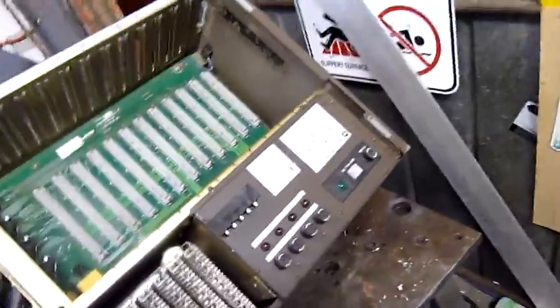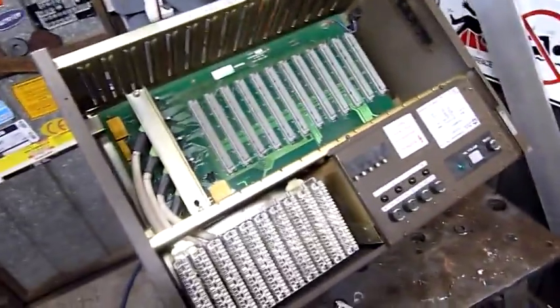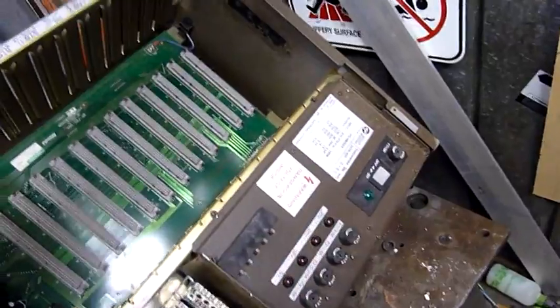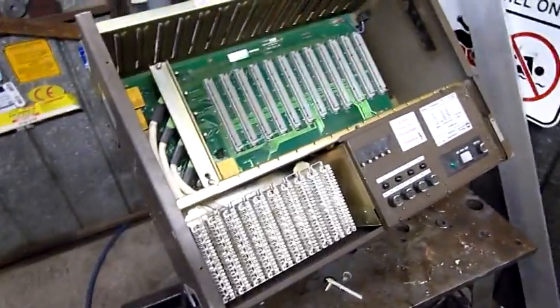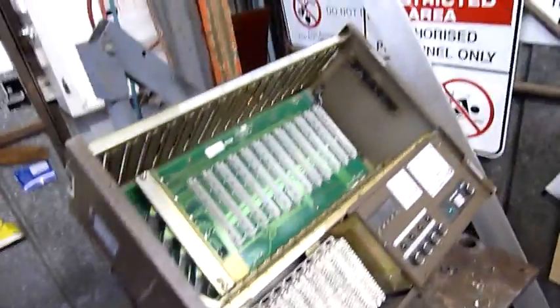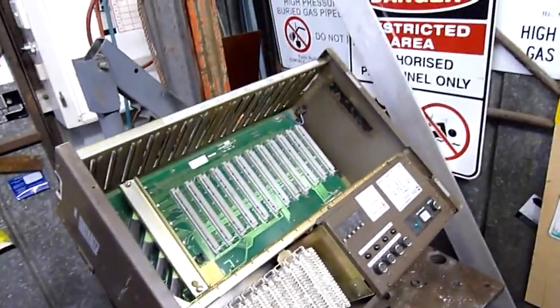That's where the interesting stuff's going to be. That power supply is short to ground, so I'm guessing it's been surged, and as someone suggested, maybe the MOVs have gone short. But it puts out 5, 12, 20 and 30 volts. So if I can fix it, it'd be quite handy. If it can't be fixed, well, who cares? It's all scrap anyway. I'll arrange this in a more easy to work on manner and work on it.